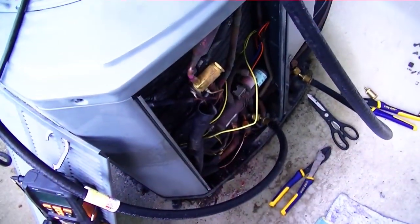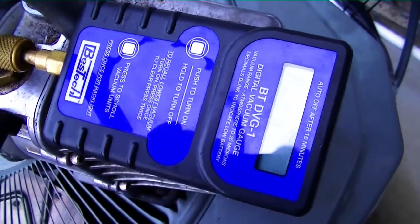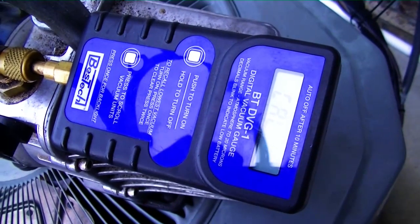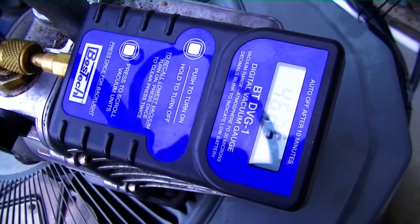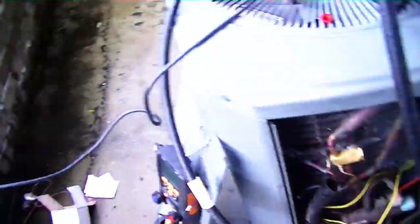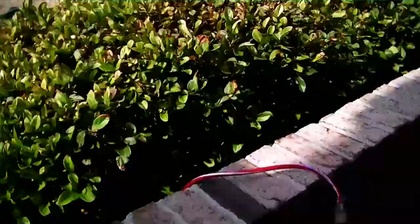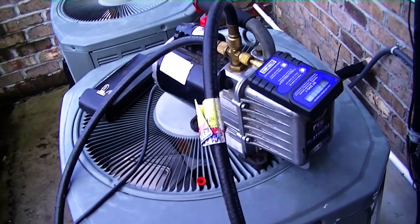We are now in a vacuum — just started about a minute ago. The vacuum gauge is doing auto calibration. We have not gotten below — well, we're at 3,600 microns, it's coming down pretty nicely. We'll let it run while I'm cleaning up my stuff on my cart over there, and we'll move on to charging and replacing the old defrost control.